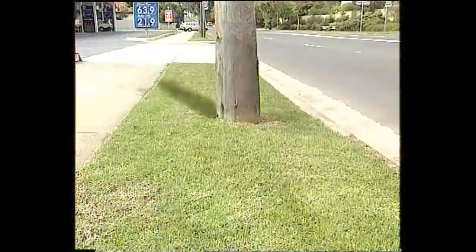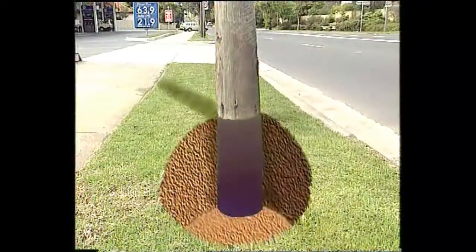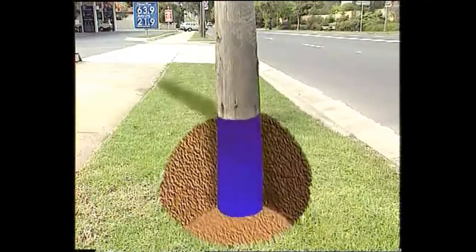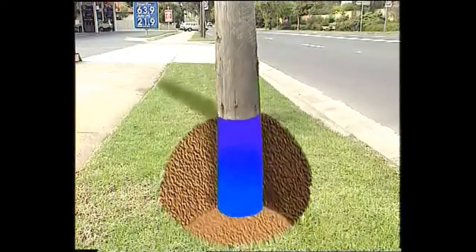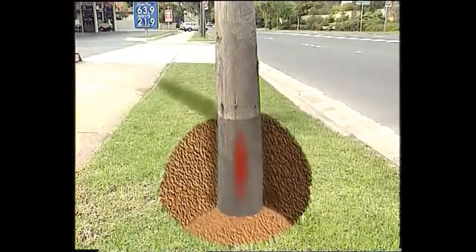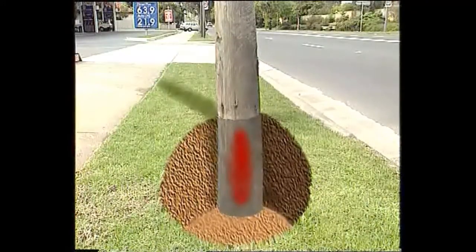So, how do they work? Wooden poles and structures are normally buried up to two metres deep. With rainfall, moisture can find its way longitudinally and radially into the wood grain. And with the moisture now contained in the wood and exposure to oxygen in the soil or surrounding air, fungi can form and the decay process begins. Replacement of the wooden pole or structure is now inevitable.